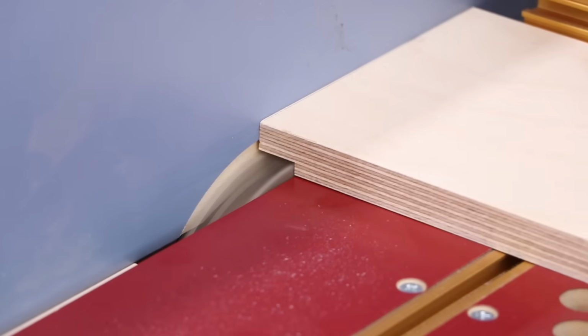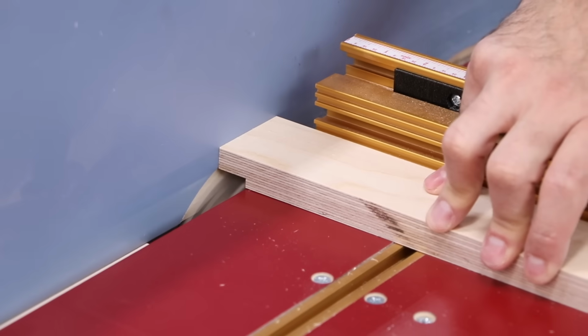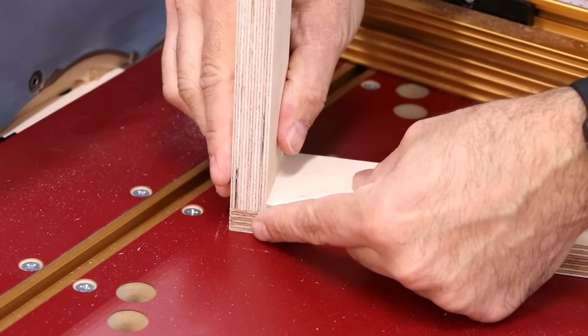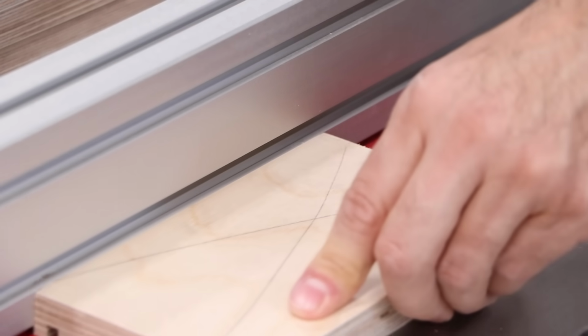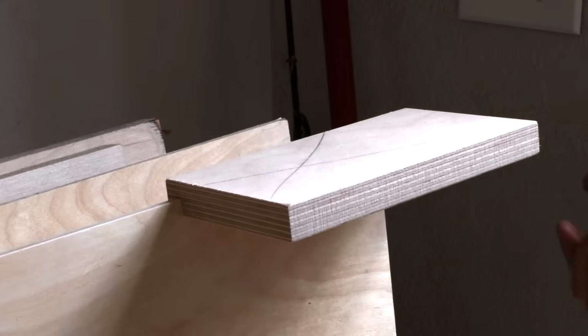With the dado blade and the sacrificial fence, I can cut rabbets in the drawer and tray sides. That's the fit we're looking for. The bottom panels will be made from 1/4-inch ply, so I'll use a dado stack to cut the perfect groove. 1/4-inch plywood is never a 1/4-inch, so I'll need to use shims in the dado stack to get a nice snug fit.